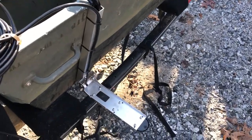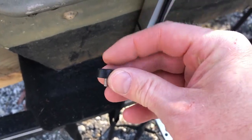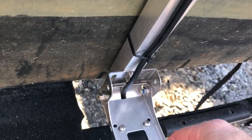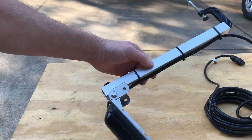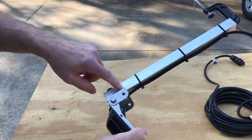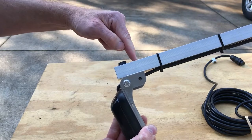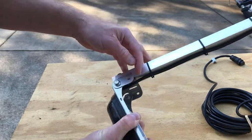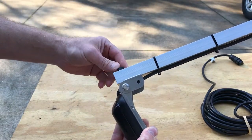So I've got it mounted now. What I'm going to do is add a little rubber foot down here so it will keep it from vibrating against the boat and putting a hole in the boat. If you don't want to drill and tap holes you can just drill all the way through, put two bolts, use a button-head bolt so it will be rounded, and then put your nuts on this side if you don't want to go through the trouble of tapping the holes.